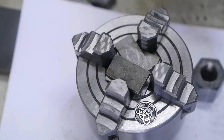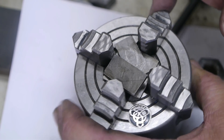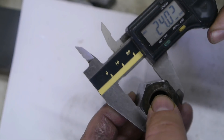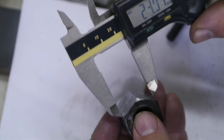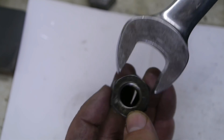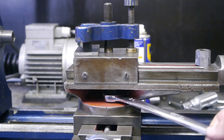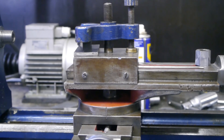Let's see — the chuck did okay, although there seem to be some burrs inside these threads here, and it's hard to turn at some points. 24.2, 23.9, and 24.2 again. Well, that's good enough for anybody. That feels so much better — I no longer have to worry about stripping the nut.